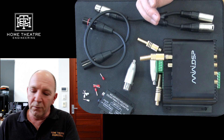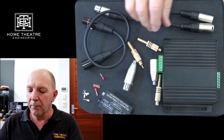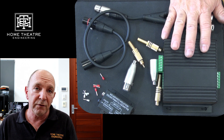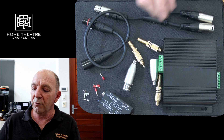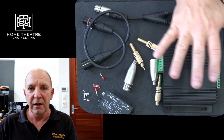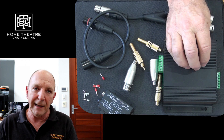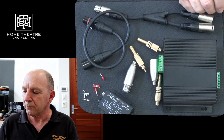What we decided to do is step away from that and go to the miniDSP 2x4 balanced. Part of the reason is we work on more balanced processors and AVRs than anything else, but we've also been faced with the challenge that an awful lot of sub manufacturers still only use an RCA output. So we have to deal with the signal and the change from balanced to unbalanced — possibly a mixture. I recently finished a job that had a mixture: one sub running off an amp with an XLR output, and the other three subs ran off RCAs — unbalanced.